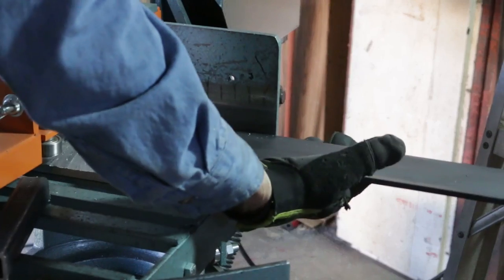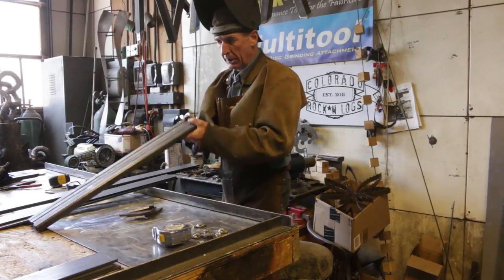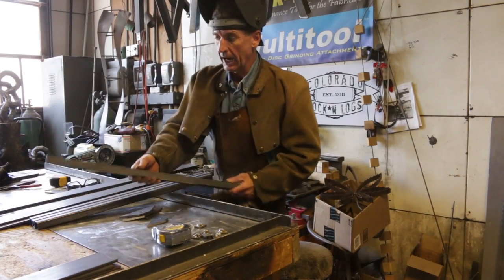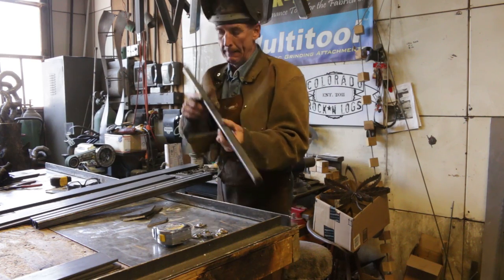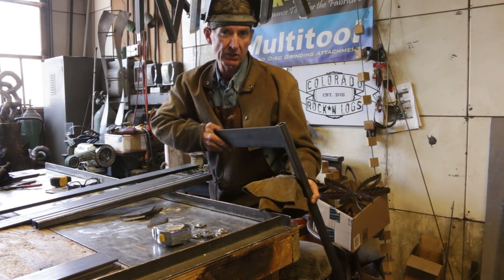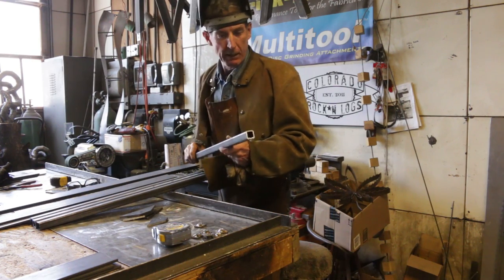Alright, so it looks like we've got all our parts cut. You can see I've already taken time to drill the little feet and add the nut for our adjustable feet. We've got our legs, our skirt, and our little gussets that we'll use to fasten the top down to the table. I've decided to use a pretty heavy gauge metal — 11 gauge one by one square tubing and quarter inch by three inch for the skirt. The reason we went with this heavy gauge is to eliminate some of the flex. We want this thing to be as sturdy as we can with as minimal parts as we can.